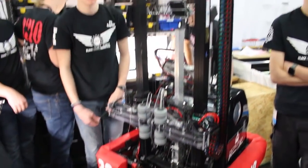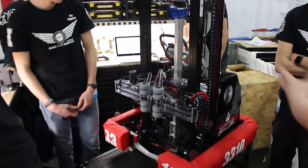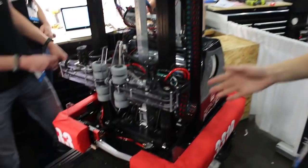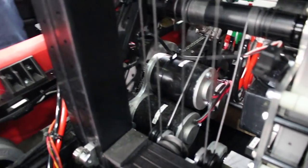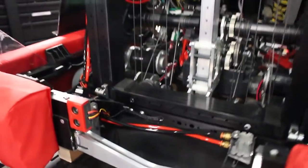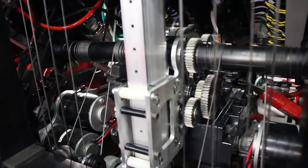Let's keep this rolling. You guys have this interesting spine mechanism in your robot. So our spine is a custom gearbox that we designed. It's actually down here on the inside of the robot, and we designed this so we can use three 775s to drive both the elevator and both of our legs independently. There are actually three shifters down there, and what we can do is the entire match, the two legs will be locked with the ball shifters, and the elevator will be driven by the three 775s.